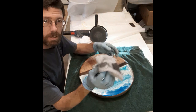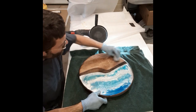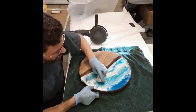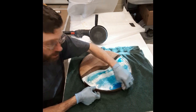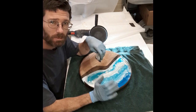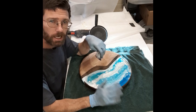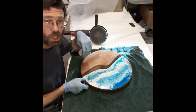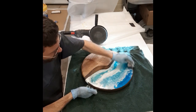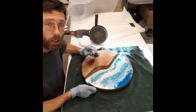After about five minutes, I'm going to take my cotton cloth and rub the Rubio Monocoat maintenance oil off in circles. What's nice about this maintenance oil is it really evens your finish out. With the 2C, sometimes it absorbs a little more in some spots — a little shiny here, a little duller there — and the maintenance oil evens it out nicely, especially on clear epoxy.